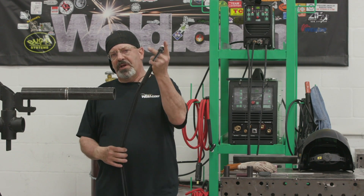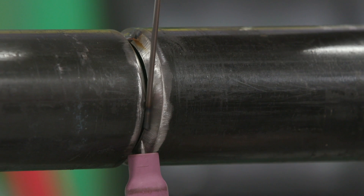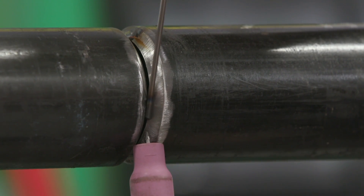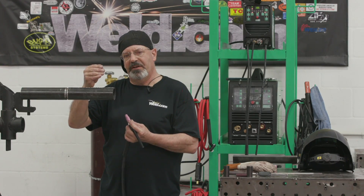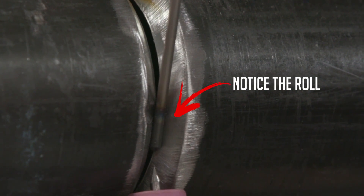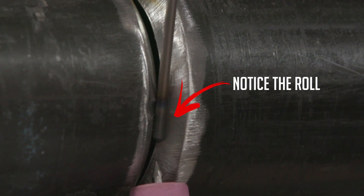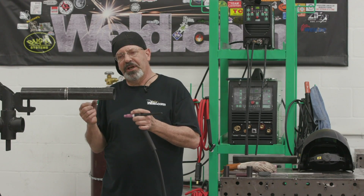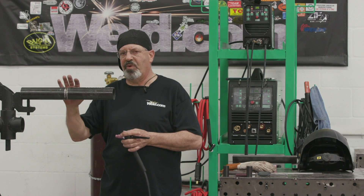My attempt here, coming off the bottom, is to strike the arc and lay the filler wire in there. Since it has a 1/16 gap — which is smaller than the filler wire — I kinda like to just put that in there and start. I like to roll the filler wire and kinda feel it, feel that fluidity in there and watch the pool, watch the sides. If I get in trouble, like a keyhole opens up, I'll add more wire, try to keep going a little faster, or maybe weave up onto the pipe wall.